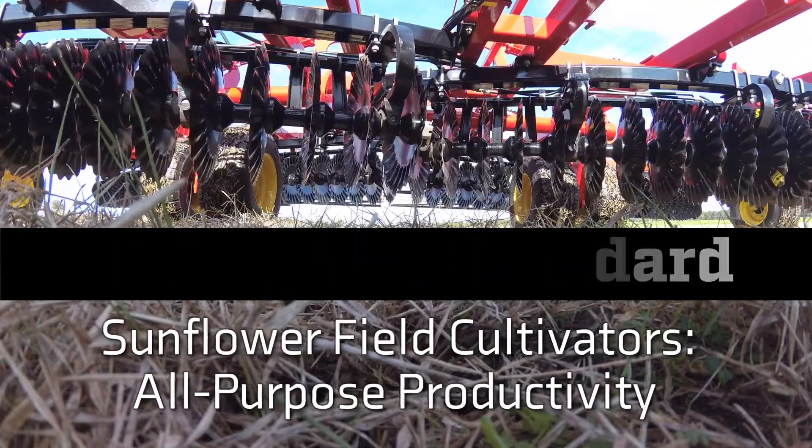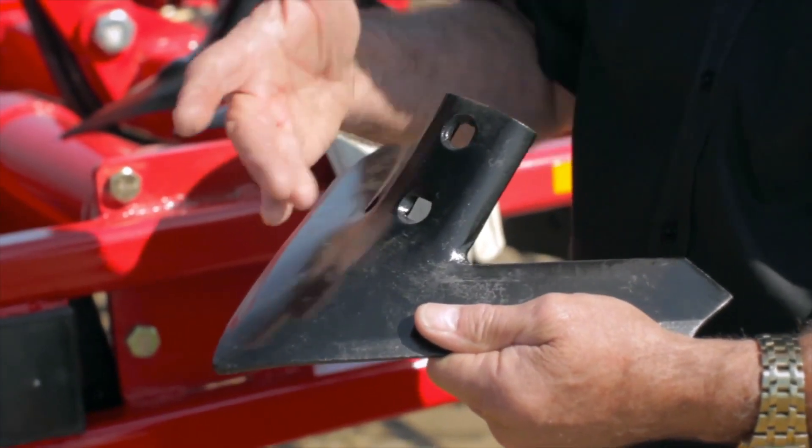Today farmers are using field cultivators almost as primary tillage tools. The sweep itself, instead of running in soil that has been loosened by a plow, chisel plow, or disc, the soil hasn't been loosened. This could very easily be the only pass the field will get. So the point loads had to be increased to keep the sweep at the proper angle. We want to define a very uniform soil profile, and that means a flat seed bed. If the sweeps start pulling back, that arrowhead shape sweep now becomes more like a dagger going through the soil, and we get a very uneven soil profile.